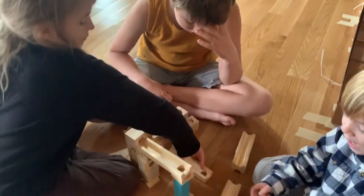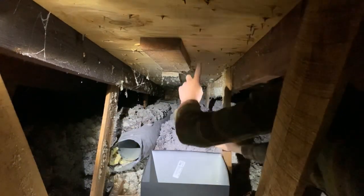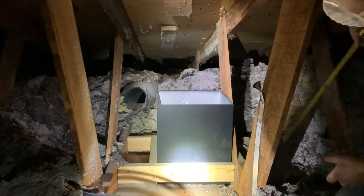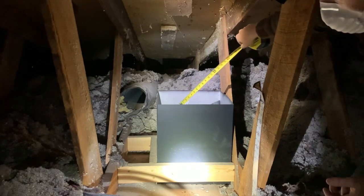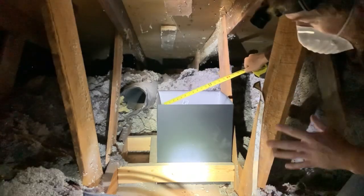I'm surprising my wife with something today, but first I have to do some chimney work. Up in the attic again — the game plan is right here. There's a seam of plywood going through, that's why they have this 2x6 here. When I bought my triple wall pipe I went ahead and bought two three-foot sections, assuming this was going to be roughly three feet in here and another three feet out the top with enough clearance. I also bought an extra one-foot and two-foot section just in case.